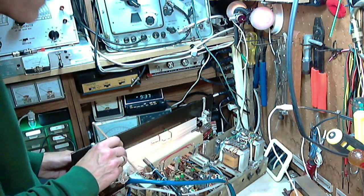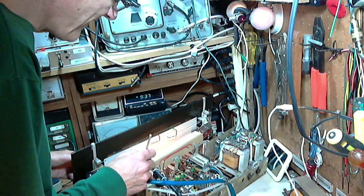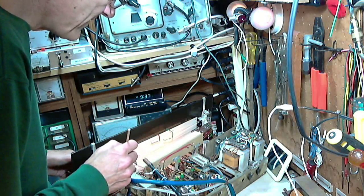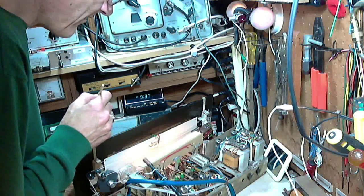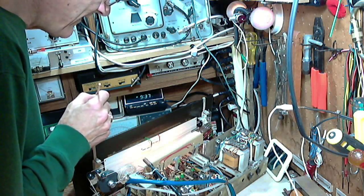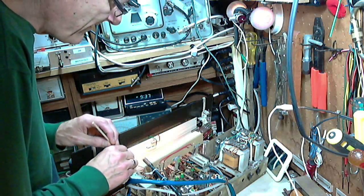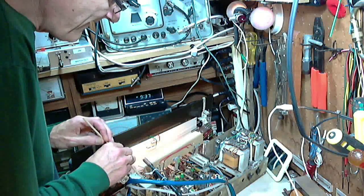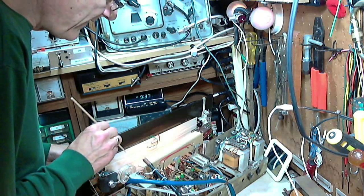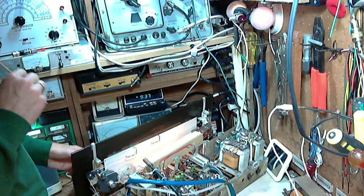Thinking it was at all. It's actually on the other side. And we're talking about just fractional different distances. Okay, let's go. And I think we're going to get another rubbing plate in here. Right in there. Now that's the one I saw. I wonder how these got bent. I'll just bend that out a bit. There we go. Bingo. Okay, cleared the short in the tuning capacitor.